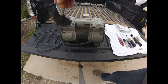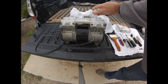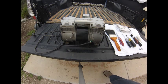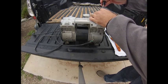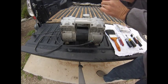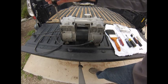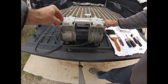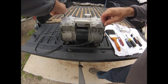We go ahead and dust this off as best we can. Now that we're clean and the lubricant has had a chance to penetrate, go ahead and remove the head screws. Go ahead and discard these head screws because the rebuild kit comes with new ones.